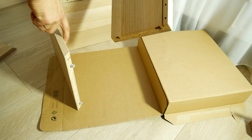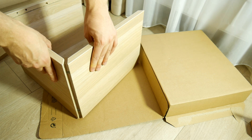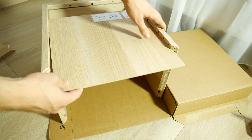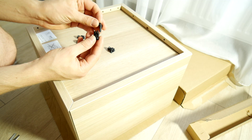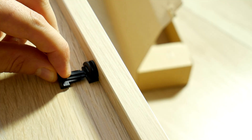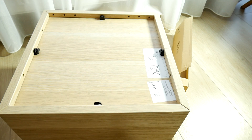Then add the next surface, but don't forget to correctly connect it. Make sure that everything in the back fits perfectly, and then just squeeze everything together. Then put in the back panel and after that put on the locking panel. Fasten it properly. We use plastic latches to fasten everything — we install them in four locations. Then we insert the locking plastic wedge into each one of them as far as it will go. Alright, cabinet is assembled.